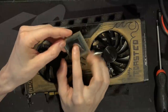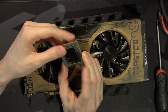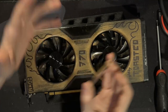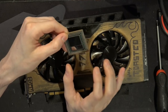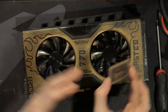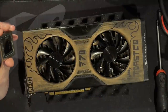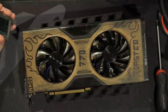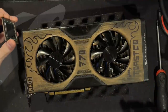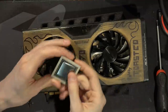The interesting thing about the FCBGA is that it can fail. As far as I know, you can't reflow it, or at least it shouldn't really be reflowable, but you can thermal shock it. Putting a GPU in a freezer can sometimes fix broken FCBGA. Putting a GPU into boiling water can fix broken FCBGA. Heating a GPU up to around 100 degrees can potentially fix damage in the connection between the silicon and the substrate.